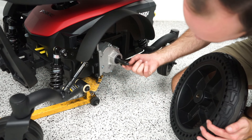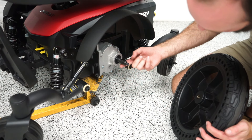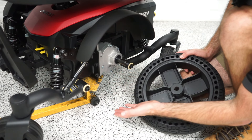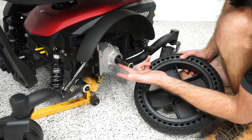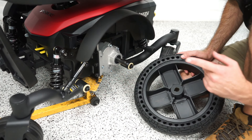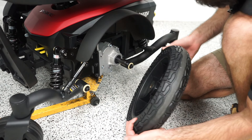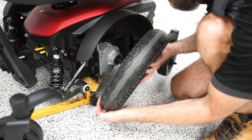Don't lose this little key down here — there's a little key that holds the tire on. You can see it fits in right here, so you might see it fall off. If it does, just make sure it's back on. When putting the new tire on, make sure it lines up with the key, with the key facing straight down in this case, and line it up.